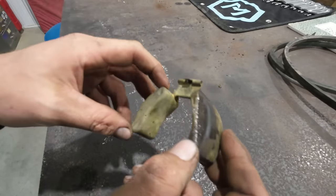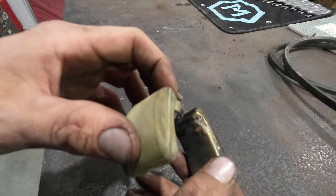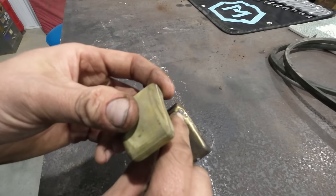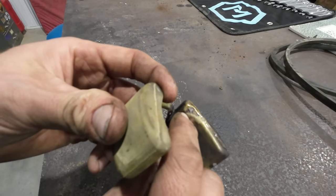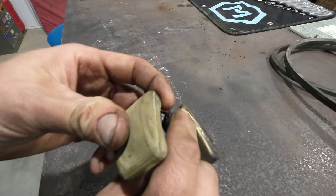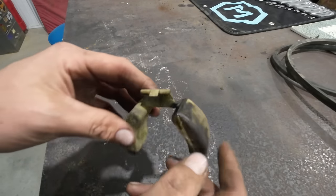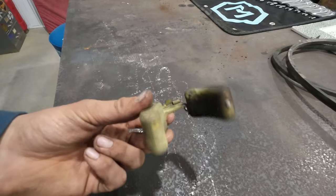So what I ended up doing there is using an epoxy sealer that is rated for gasoline on there, and hopefully that seals up the area, because there's a little dent right here, I don't know if you guys can tell, but in that crease is where the two pinholes were that were leaking. So I got those sealed up, and hopefully this thing floats now.